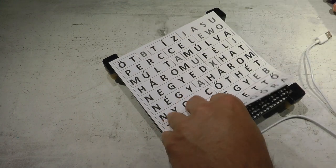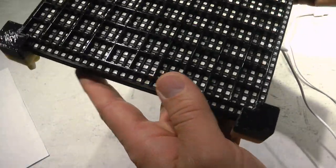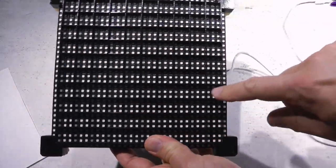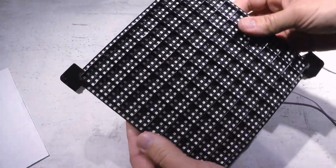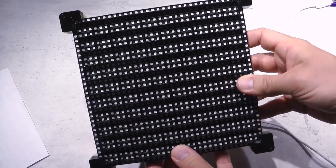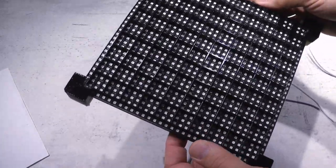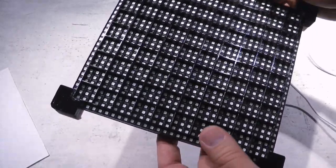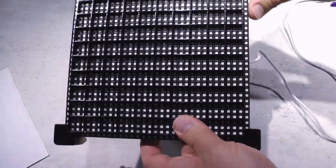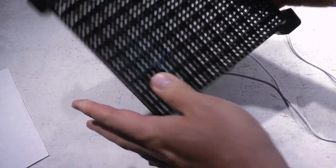I fixed a piece of paper with two clamps. It's difficult to see because it's black on black, but I have a 10x10 matrix which covers the 30x30 inner pixels of the display. I'm just not using the outer rows and columns. This was the easiest way, since 32x32 is commercially available — and 64x64 I couldn't find — so 32x32 at 192mm square is the biggest form factor I could get.